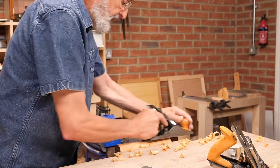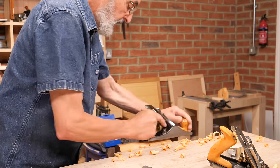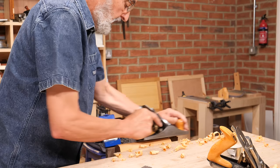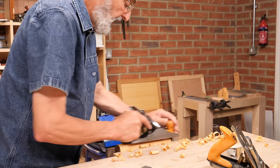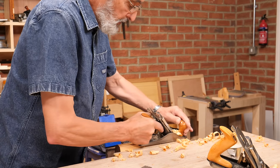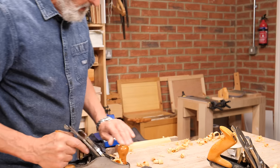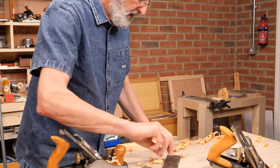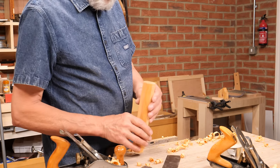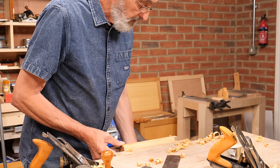But I'm going to use the end grain marking as the reference for me to check my accuracy with the plane. So I'm rotating onto the flat face and then back around to the opposite corner, which I'll be removing next. Once I have that, I check it to see I'm dead on this line, I'm dead on this line. What I do now, just lock it in the vise,